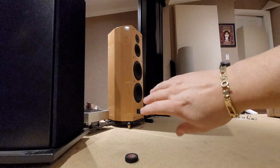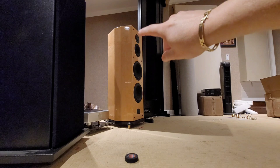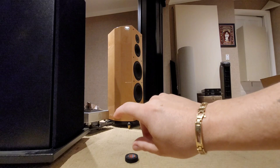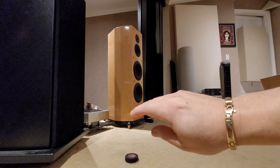But that's not necessary, because this thing doesn't need the full frequency spectrum. It's only powering the tweeter. It only needs the very top frequencies, you know? So you want to cross over the signal before the amplifier, and then each amplifier is much more exact at its job. There's no wasted energy being bled off to heat. It's only doing the frequency that it needs to do.